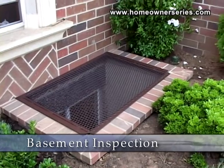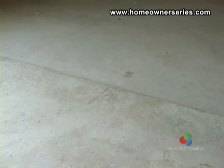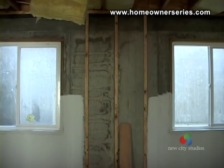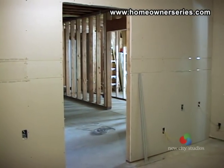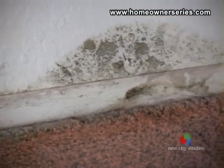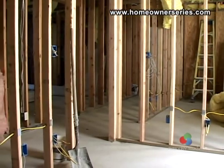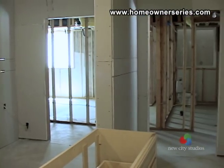If your home is built with a basement, then you have easy access to inspect its structural underbelly. Any exposed concrete slab should be inspected to make sure it is free from those large cracks you can fit a pencil into. The basement walls are the foundation of the home and should be inspected closely to make sure there are no large cracks or efflorescence. Often walls are covered with drywall or paneling, so inspecting the foundation walls can take some ingenuity. Clues to look for are discoloration in the drywall and wet or moldy paneling. If this is seen, then there is a problem and the wall is not draining or drying out properly. Modern home science also suggests that the basement should be insulated, cooled, and heated along with the rest of the house to prevent the growth of mold.